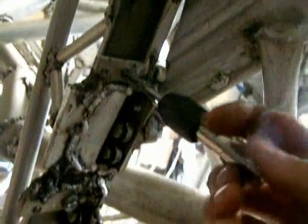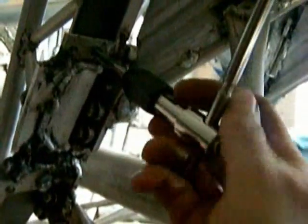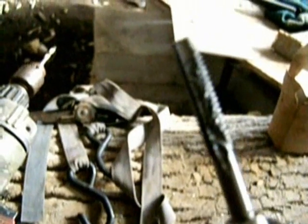And when you're done, just unscrew the sucker. Just hanging on by a thread — literally. You have to make sure you put lots of oil on your little tap, or else it gets dull real fast. You can get these to match just about any bolt, which is pretty sweet. And then you can stick your bolts in the hole. Sorry if that was redundant for some people, but that's very useful information for some people.